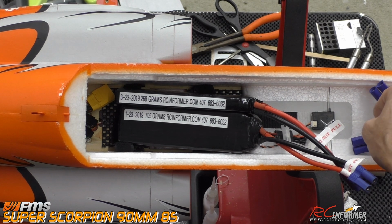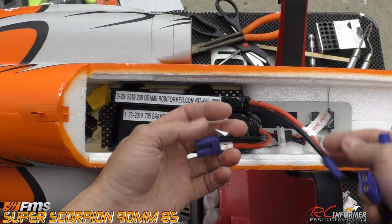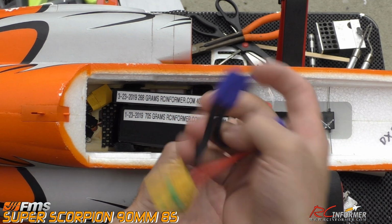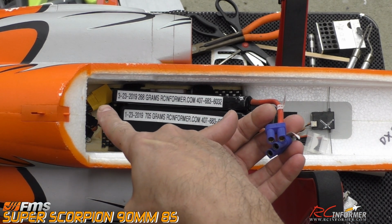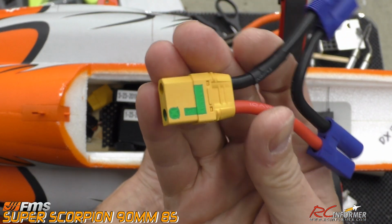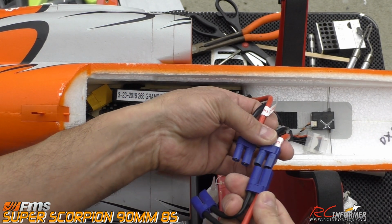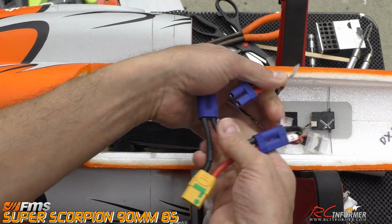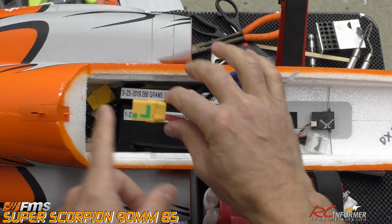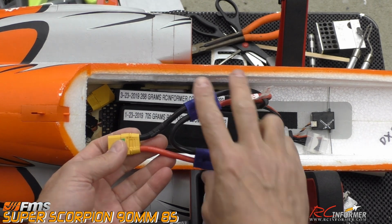Now, keep in mind when you're doing this, you're going to need a series adapter. Okay, so these batteries are running in series. So I went ahead and made one of these, just because I didn't want to change the adapter on the speed controller that's in there from the XT90. What I did is I put a spark arrestor on there. So this is one of those special spark arrestors. I'll put links below in the description for that so everybody can check those out. But essentially all you're going to do here is just connect these together like this, and then your final connection can be made right here when you're ready to go fly. Just plug that in and you'll get no spark. So that's pretty much that.